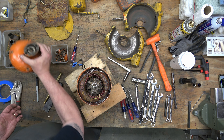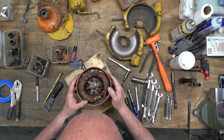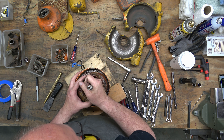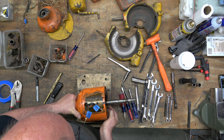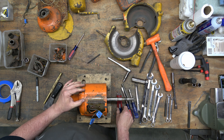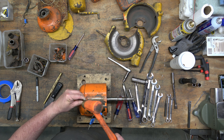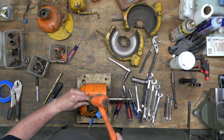The only thing we've got left on that piece is just to get the bearing out of there — we'll do that in a minute. So it would be great if we could just lift this rotor straight out of the stator at this point, but that's not going to happen. We just need to get the right side bearing housing off. I'm going to mess around with this small chisel and see if we can get a gap going between the bearing housing and the stator.